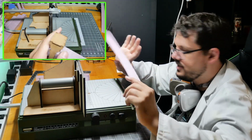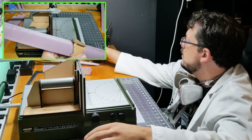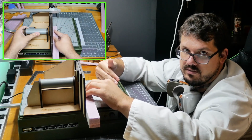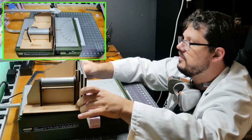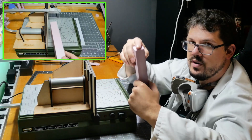This is whatever excess you had. Then what I did was I took that square chunk sideways and then really squared off an end. So basically I put the chunk like this, and then I turned on my hot wire cutter and I moved it forward until it was cut. That perfectly squares an end.